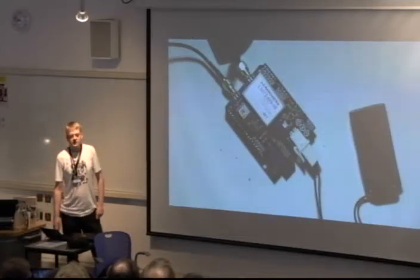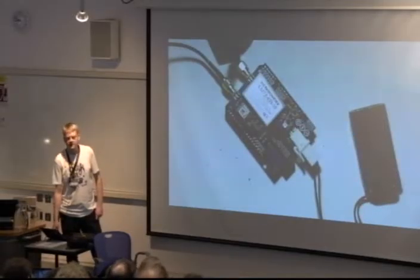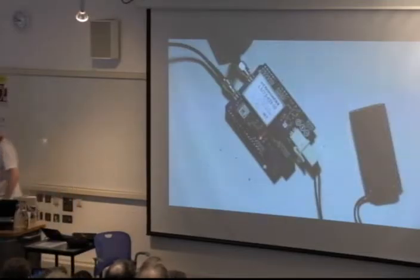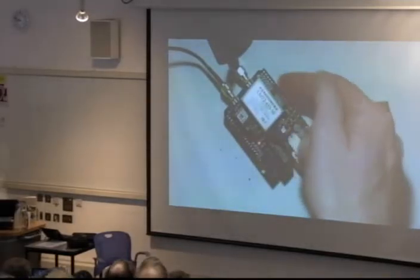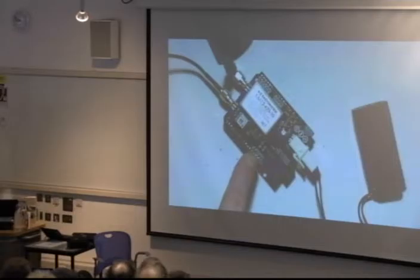What's the interface for the sensors? That's just a DS18B20, so one wire on that. All the pins are actually broken out, so if it runs on Arduino, down there you've got all the normal Arduino pins, and you've got the SCL pins, but you've got to remember it's 5 volts, not 3.3. So whatever you plug into it, you're going to have to use level converters or something.